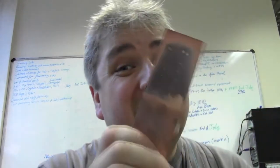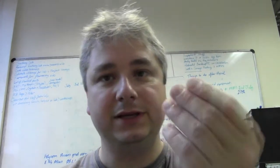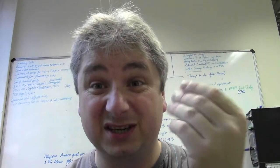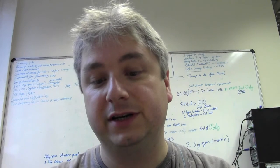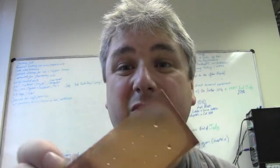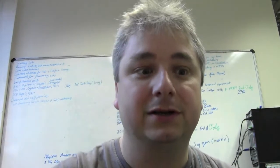If you're holding onto your board for a very long time without any gloves on, you can affect your plating. Skin does contain acid, it contains salts, it contains grease. It will oxidise your copper on contact. I've just been holding this for a few seconds, and as you can see, it's getting all tarnished and crappy up one end. It's still perfectly fine where I haven't been holding it, in the tank. That's only 20 minutes. It definitely does make a difference.